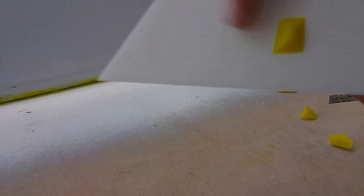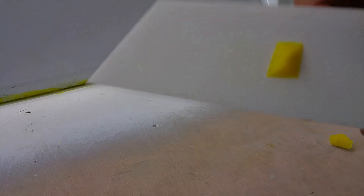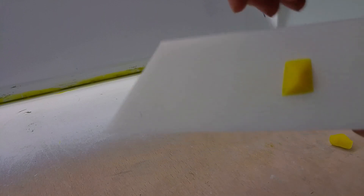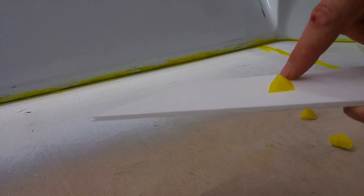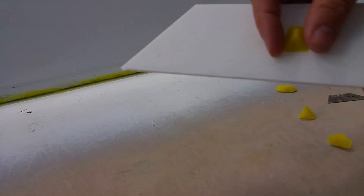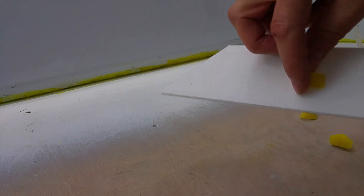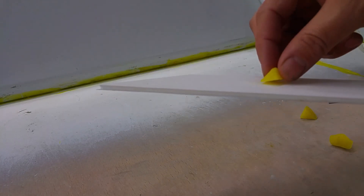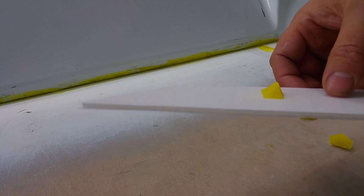I haven't done a very good job on that one but you get a nice little sharp locating pyramid. This will be the flange on the split mold and this will just help to locate it nicely. We gel coat over this, then fiberglass over it, and when this is thrown away you rip it off. The wax will actually end up stuck inside, you dig it out and you have that shape made out of fiberglass, so it just helps locate the split part of the mold together.